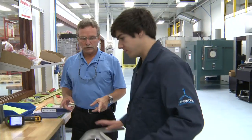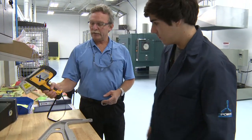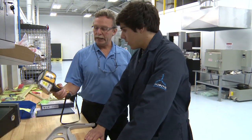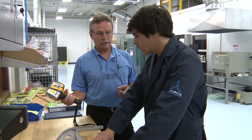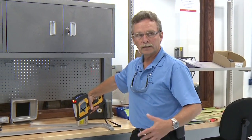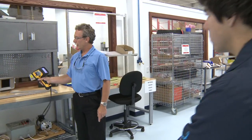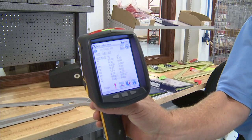We have the raw assembly here. And here we have an XRF analyzer — a handheld device. As I had said, it shoots X-rays. You can see it's activated there now because the lights are flashing — that's letting you know that it's shooting X-rays. And then you can actually shoot it, and you can see that it's made of 7075 aluminum.